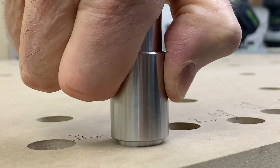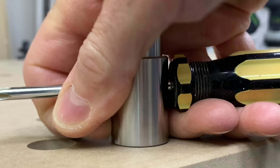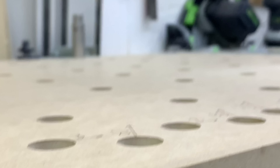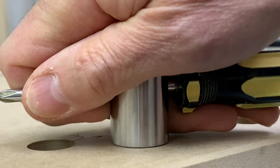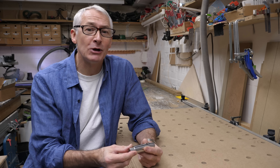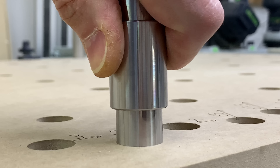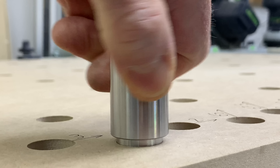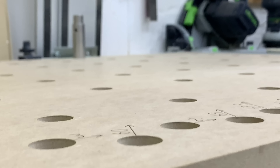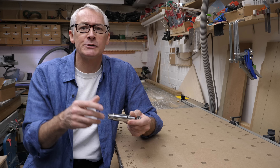They're such a snug fit that each of them has a hole drilled through so you can use a screwdriver or a Tommy bar to help wind them out if needed. In addition, they're double-ended with the opposite end machined five hundredths of a millimetre — 50 microns — smaller, so that if your Vario Bench top swells slightly over time due to damp conditions, you can switch ends and still achieve the required fit and accuracy. The Bench Hooks are also threaded at each end and come with a corresponding M8 knob, just in case you need to lock them down completely.